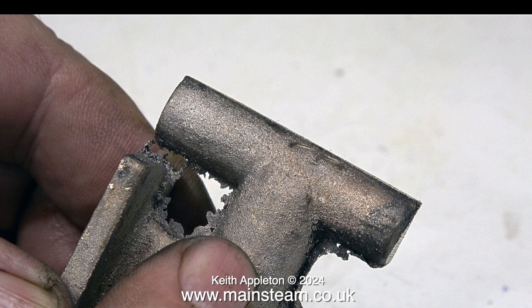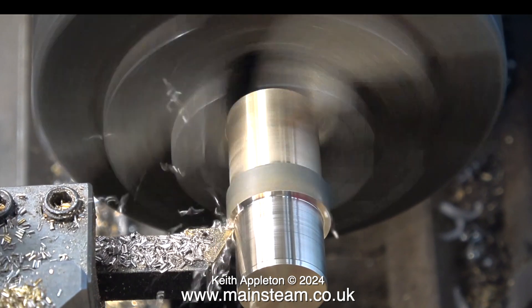How to make your own steam engine and water fittings. As there are many commercially available steam engine and water pipe fittings out there, why do I need to make my own? Well, I want to make a T-piece, and I'm thinking about using this water pump casting. The T-piece I need has two male threads and one female. I bought this casting from Black Gates Engineering — it was about the nearest we could get.